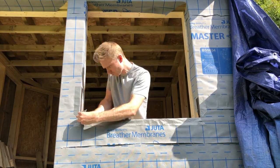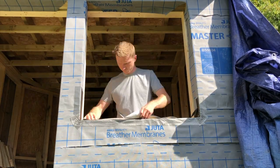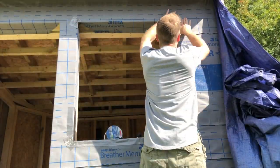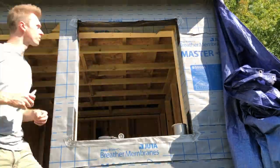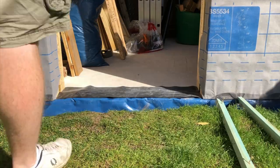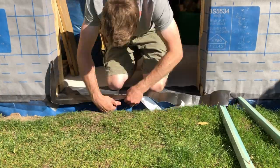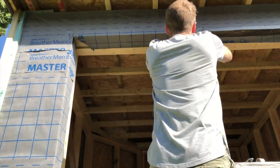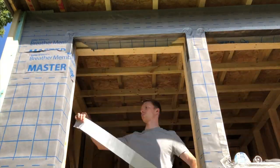When it comes to installing the door and window I'm pretty much using standard building techniques. One of the first things you'll do is put some flashing tape around the edges of the window to help create a watertight seal. You can use Tyvek flexible tape which is very good but quite expensive and comes in long strips — worth getting if you have several windows or large bi-fold doors. In my case I opted for butty bond which is cheaper, but it's not quite as flexible so I'm having to cut and do a couple of patches around the corners to get a complete seal.